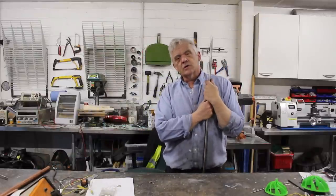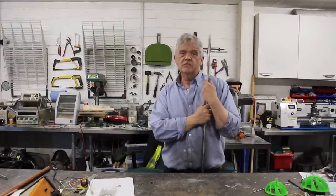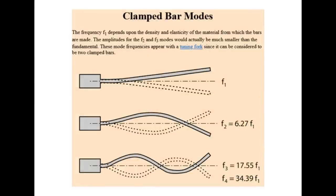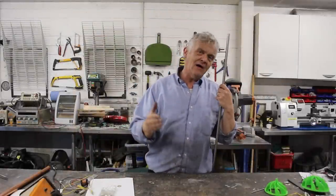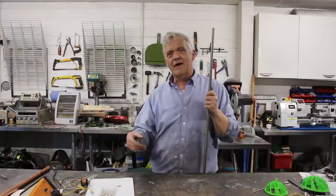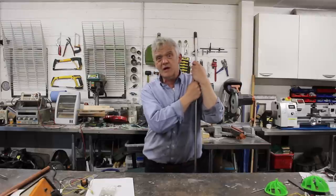When you're looking at making a piezoelectric fan or solid state fan, you're more involved in music than electronics. If you know the material, the frequency, and the Young's modulus — which is a measure of the elasticity of the material — you can work out how long that piece of material has to be to get it to resonate. Normally we're going to use this in equipment you plug into the wall socket, so ideally around 50 or 60 Hz is what you want the resonance frequency to be, because that single-clamp fundamental will give you the biggest range of movement.